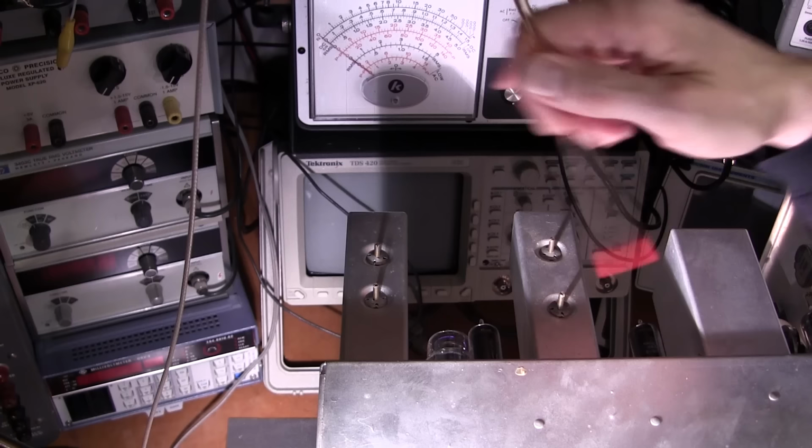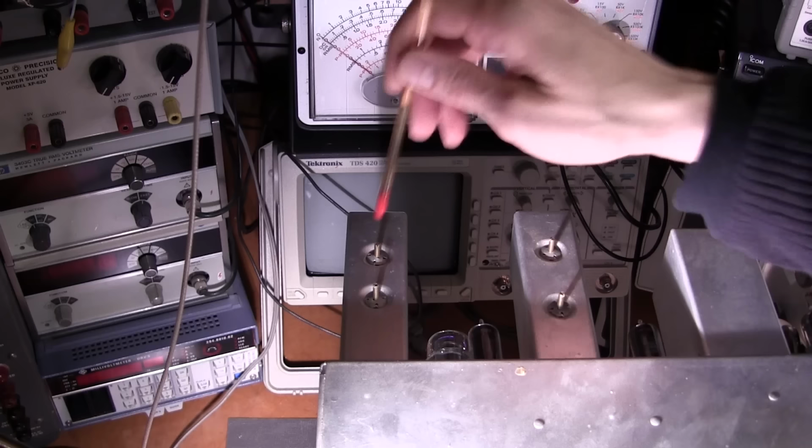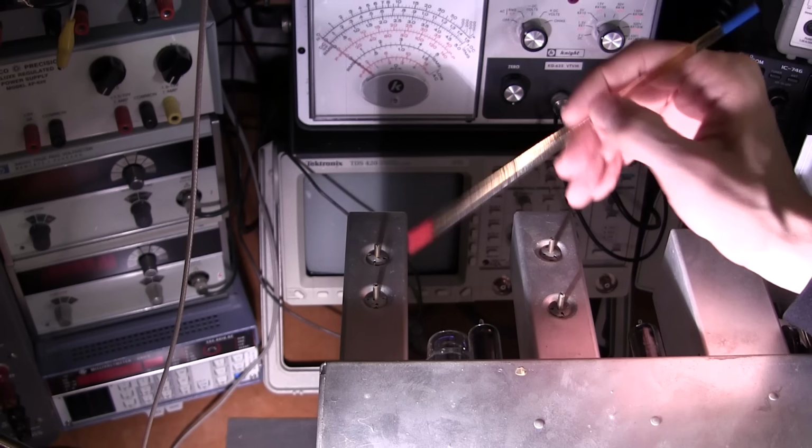First thing you're going to be doing is tuning for the peak at the center frequency. After that, you're going to be spending a whole lot of time trying to match their selectivity curves from just going back and forth and figuring out all the slugs. From what I'm telling you, these will affect the waveform that you're trying to achieve very little. You're basically tuning these for a peak at the center is all you're going to be doing. You won't be tuning these very much. You'll just leave these alone.